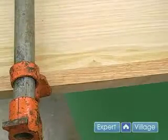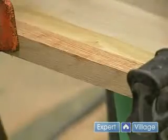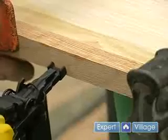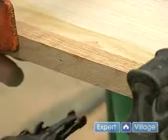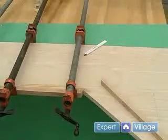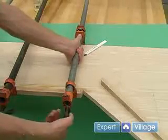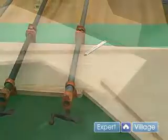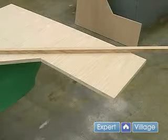I'm going to do this for the top and the bottom. Next, I'm going to put just a few pin nails into my trim so that the nails will hold it while the glue dries. When I remove the clamps now, the pin nails will hold my trim on while that glue dries. I'm going to continue this same procedure with the rest of my pieces.